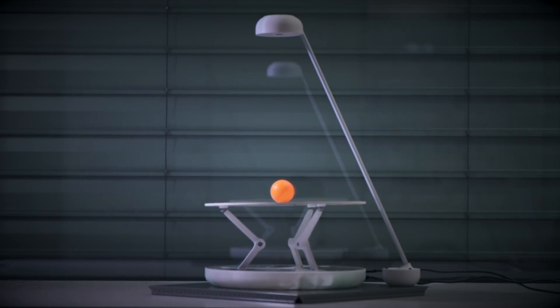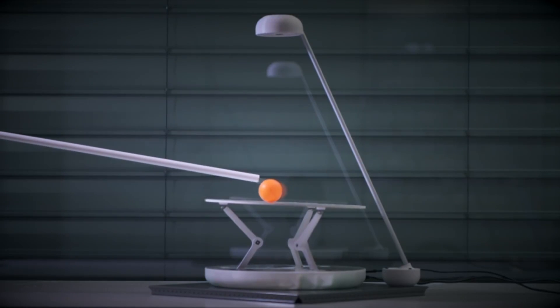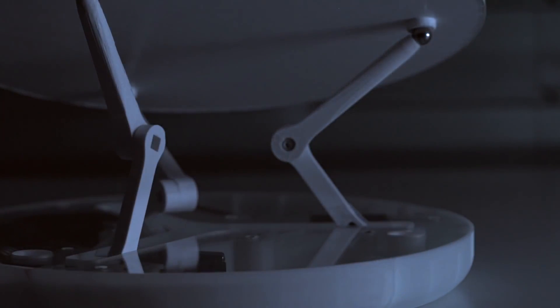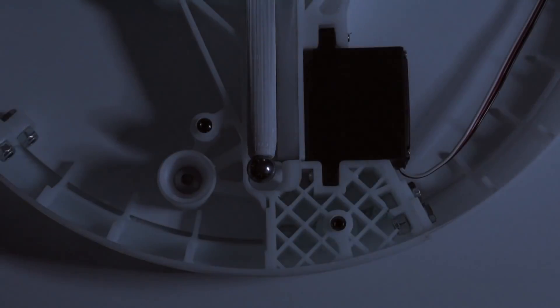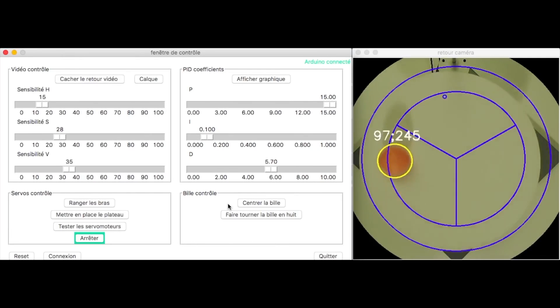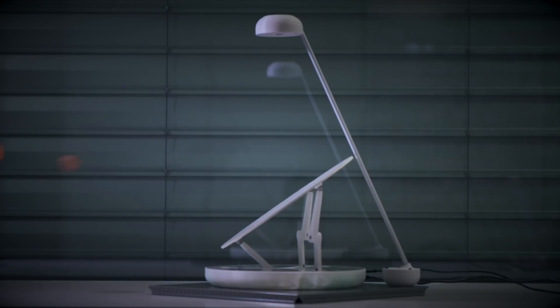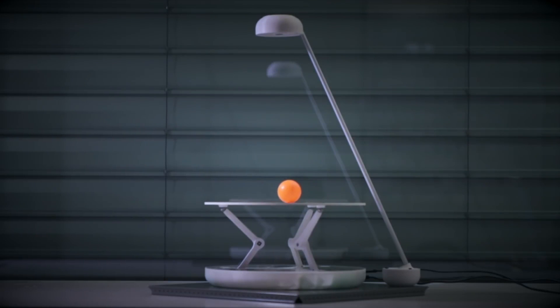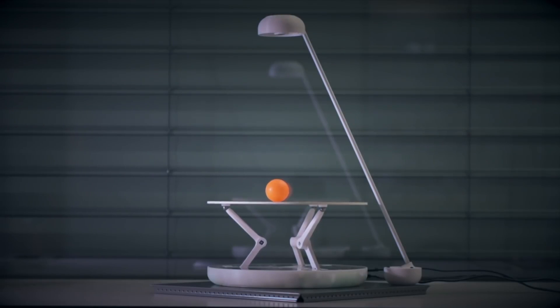With the project of the week: if you ever wanted to play catch with a robot, Johan Link has this incredible guide on Instructables for making your own ball-balancing platform. The base uses three servo-controlled 3D-printed arms to move the platform around. The servos are driven by a custom Arduino-compatible board based around the Atmega 32U4 microcontroller — the same chip used on the Arduino Leonardo. The real brains of the operation is a Python program on a nearby computer connected to an overhead webcam that detects the position of the ball using OpenCV. Based on the ball's position, the program calculates how to move the platform to stabilize it. It's a super cool project and something that would drop jaws at a science fair.